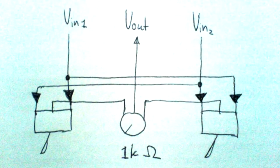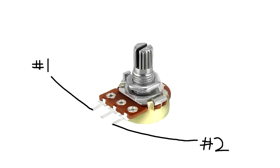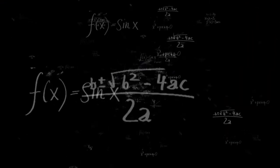Recently I've been looking into video synthesis and visual glitch art and came across a schematic for the dirty video mixer. How a dirty video mixer typically works is simple — it's two inputs running straight through a 1k potentiometer and straight to an output. The two input signals are fighting each other, mismatching impedances, and creating all sorts of problems, which results in a dirty video full of glitches.